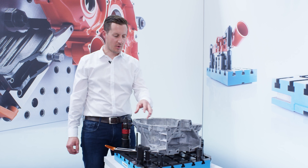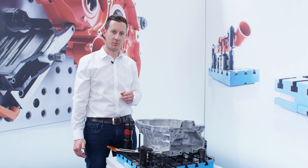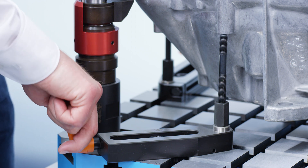As you can imagine, machining in this area will generate vibrations, which can, however, be suppressed with the help of the bedding support. The bedding support contours to the workpiece with a light spring load and is locked in place.